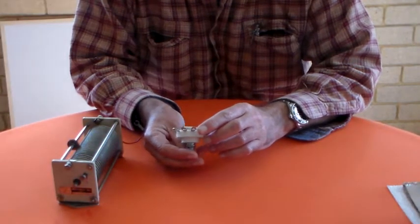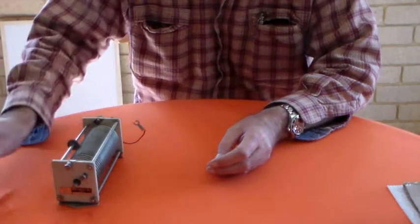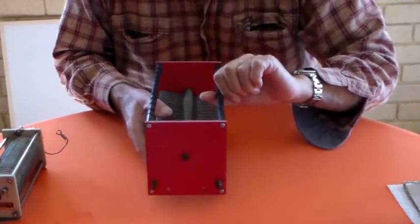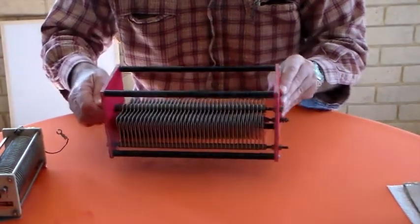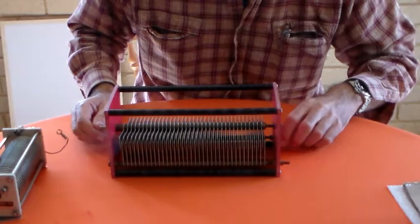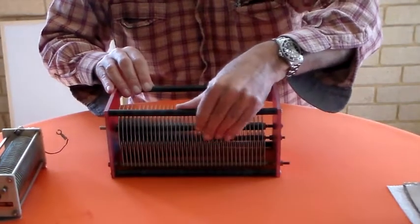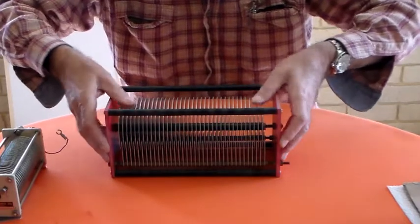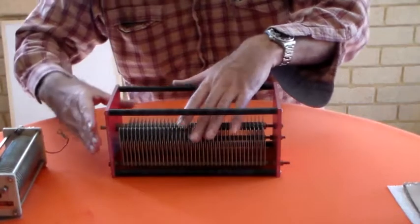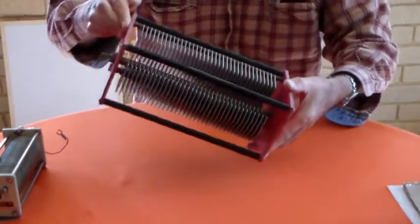I might be able to arrange a stop on the switch so it only goes one position or the other. And here's the capacitor — it's a 1500 picofarad unit. That's what the plate spacing looks like. I'm hoping the minimum capacitance will be enough for what I want; I'm sure the maximum will be fine. I should be able to tune 80 metres and probably even top band with a 1500 pF capacitor.